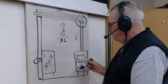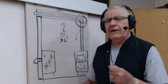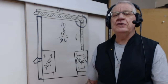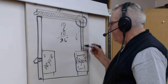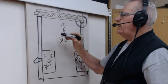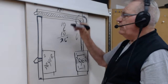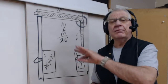26 feet. Well, this poor dryer down here is trying to take all that dampness, all that moisture after washing the clothes, and send all that moisture to the outside. And believe me, folks, the efficiency will go down the tube. Okay? So you have to get rid of as much of that ducting as possible. Don't use the plastic junk. Use the aluminum or the straight galvanized pipe, and you'll get the efficiency. It's nice, smooth lines, and it can blow that air.